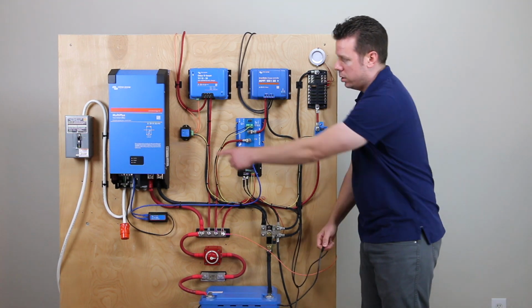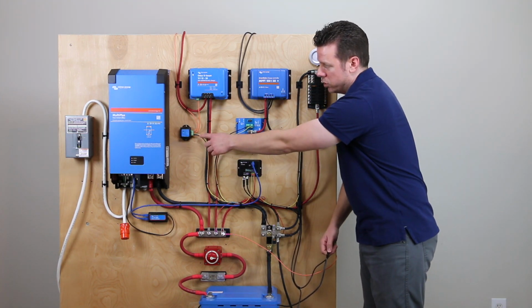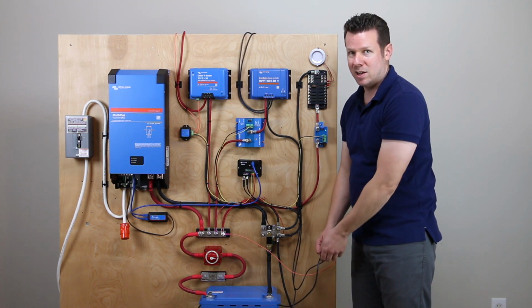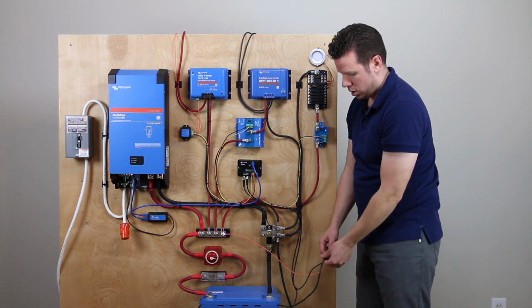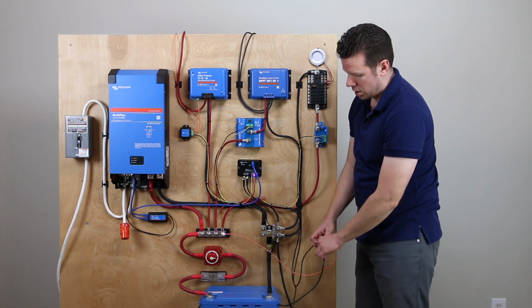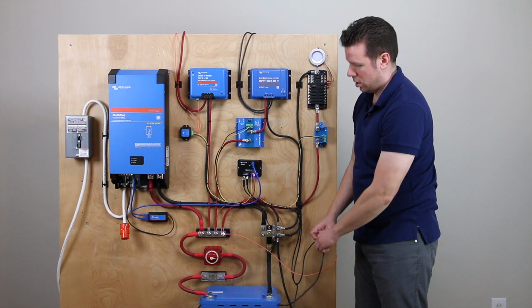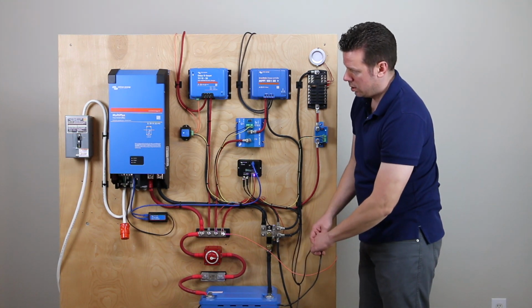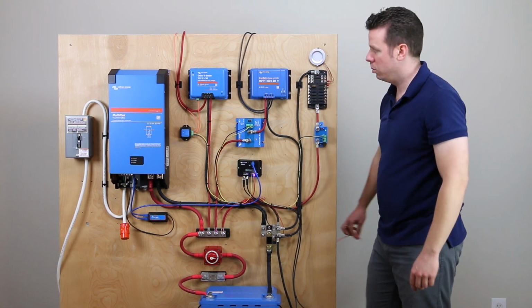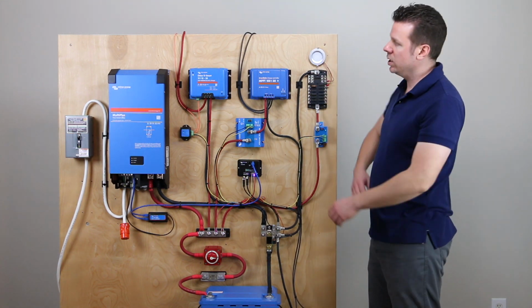So that is how the BMS, using that yellow wire, can open that switch and break the ignition line before it gets to the charger. So we'll reconnect our battery. You can see the light is on, everything's all good. And I'm going to go ahead and disconnect our ignition wire and move on to the next charger.